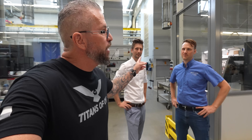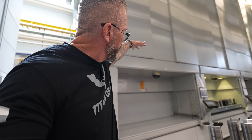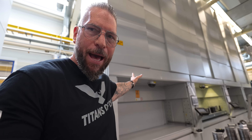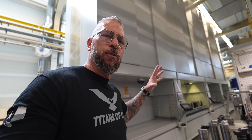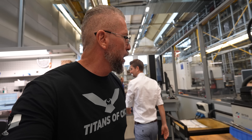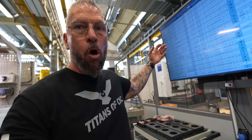We're going to go into this area right here — this is where all the tools are stored. When you look at drills, end mills, boring bars, inserts and all of it, you go into a computer, list what you need, and everything comes down right there and you grab that tool. Inside this cabinet right here, there is about $6 million worth of tools — about 15,000 different tools equaling $6 million. This board right here has every single tool being called from the different machines.